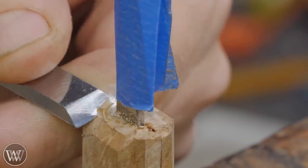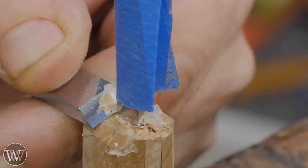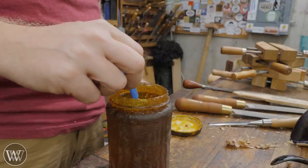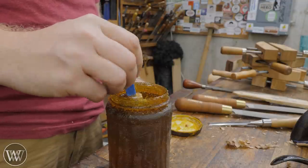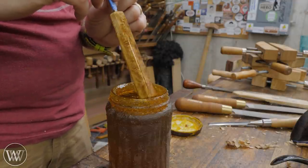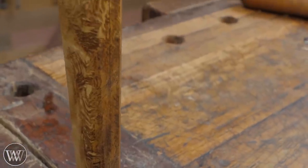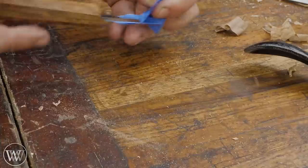The epoxy that's squeezed on top — with a very delicate hand we can come in and peel that off and chisel everything back to the main surface. And just like that, with a little bit of fiddling here and there, you have a finished knife. For the finish, we're going to do boiled linseed oil and paste wax. With live oak, boiled linseed oil and live oak are just made to go together. You get this amazing grain that suddenly explodes — the color differences, the light and the dark and the swirls. Pure heaven. I'm going to let it soak up as much as it wants, probably leave it in the boiled linseed oil overnight, and then I'll come in with the paste wax and buff it down.